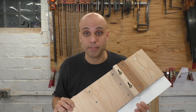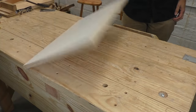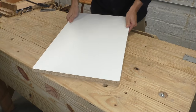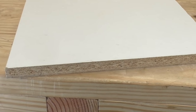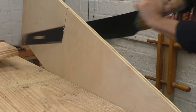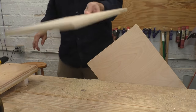If the original fence isn't 100% perfect, the movable fence can be shimmed, trimmed, or adjusted to make everything perfect, and if it ever needs to be replaced, you can just replace this one little bit. Traditionally, shooting boards were made from solid wood, but that stuff moves, and seasonal movement is going to throw our shooting board out of square. For this build, we're going to go with engineered materials. The base of my board is a piece of melamine — it's really flat and stable, just particle board with a plastic coating on each face. Melamine is what most IKEA furniture is made out of, so just wait until someone's throwing away a cheap bookcase and grab the shelves. You're also going to need a half-inch thick piece of some other engineered wood. I'm going with birch plywood, but you can also use MDF or even more melamine.